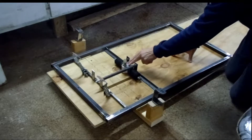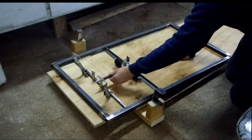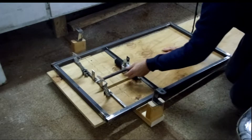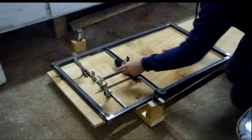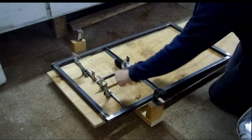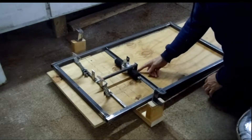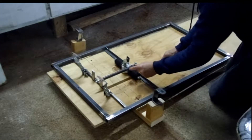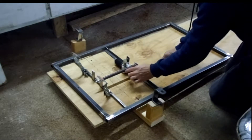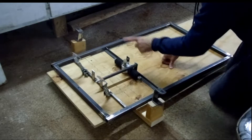Notice we got a small rack and pinion here. On this tube, I got bushings on the end — oil-lite bushings — because they don't really need to move a lot. I've got an 11-inch bolt going down through there. You've got to stabilize the twisting. I'll probably weld some more structure here for these brackets, and then come off with a 1x2 to keep that stabilization with another piece connecting to these on both sides.